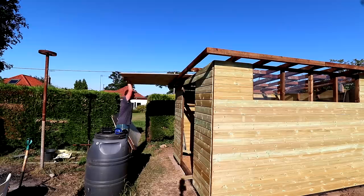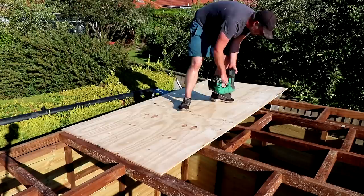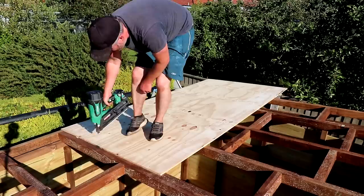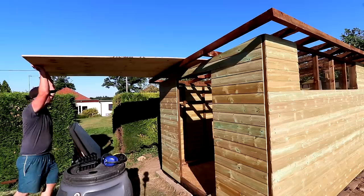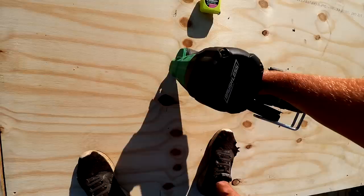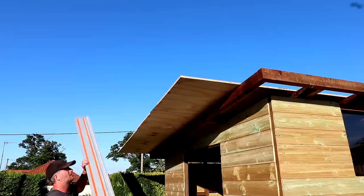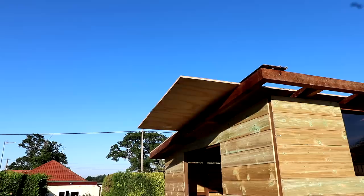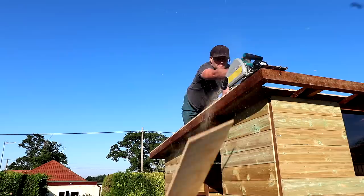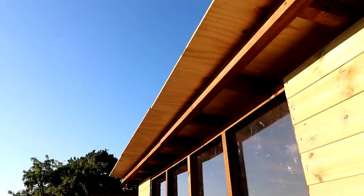On the plus side I could use more of the 50mm collated nails I'd used for the cladding to add the roof sheathing, so at least it wouldn't be too time consuming. I wanted to get nails through all of the joists and noggins to keep everything nice and rigid, so I'm marking out the position of the noggins underneath so I know where to fire the nails. Surprisingly I didn't get any blowouts at all — all the nails went into the timber, which was a nice surprise. To cut the sheets to size I put my guide rail up onto the roof and made the cuts in situ — the quickest and easiest way, with no measuring and marking required. The offcuts covered the rest of the roof, secured and cut to size in the same way.